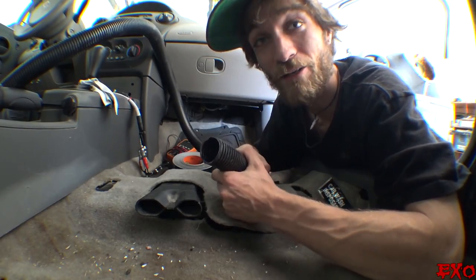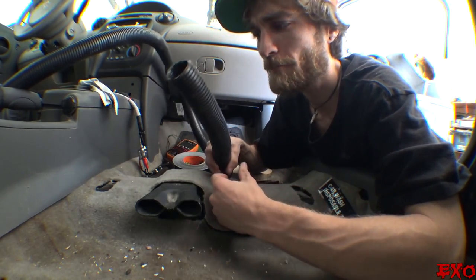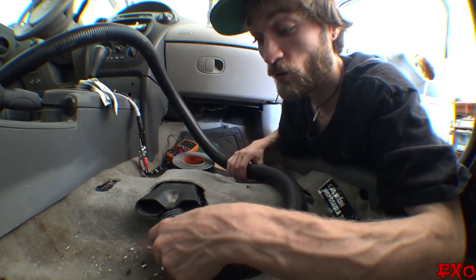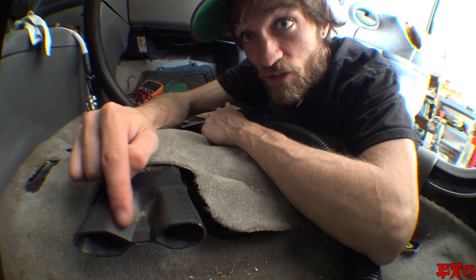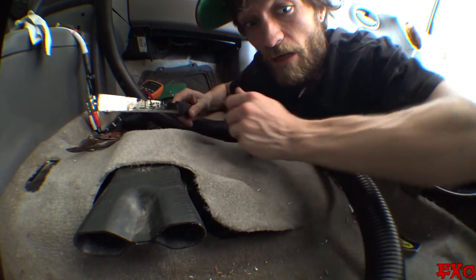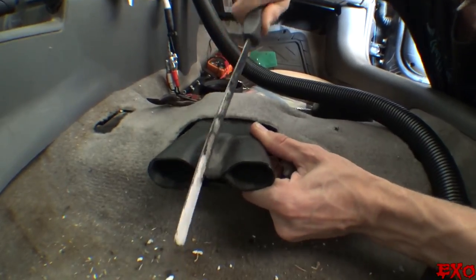The sizing couldn't have worked out better, guys. We've got the little pipe right here — the little plastic corrugated plastic pipe. Nothing fancy. I got this on sale for like 10 bucks for 20 feet. See how there's a solid piece in between here? I'm going to cut that out with this knife. That way we can get a tighter fit around this pump button.